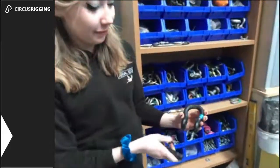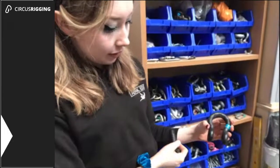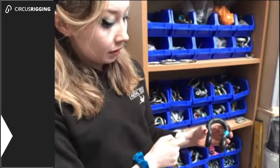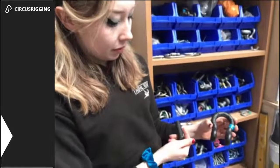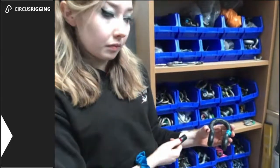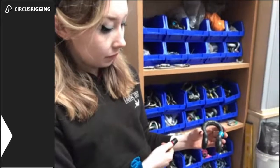And you'll notice the one side's threaded, the other side's got quite a big hole in comparison. Mm-hmm. It's not just because it's not being threaded, but it's to allow a bit of movement, because when you put 3.25 tons on it, the whole thing's going to shift around slightly, and you don't want it to bind. So it's important for the pin to be able to go in and locate, because the pin isn't a bolt. It works like a beam supported at each end, if you imagine. This is why it's good practice to put the load in the middle.